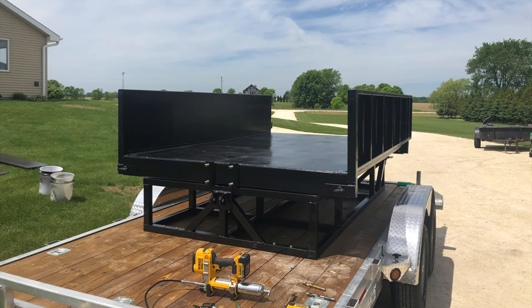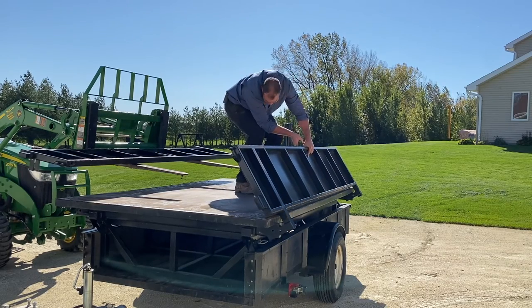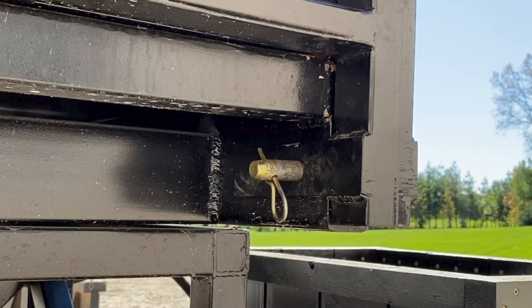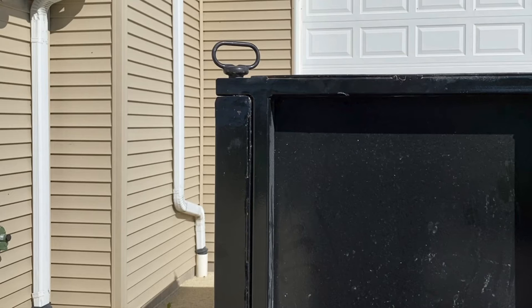The face of the sides are 11-gauge steel that's bent on a brake — I took those into a professional shop to have that done to strengthen them up. They're bent over the frame that was made, and they just tip up into place. The pins go through the bottom to keep it from pushing out, and there are pins at the top as well. Those little quarter-inch steel plates go over the front support and go through with pins and it all fits perfectly. The front also has mounts for the hydraulic ram. I made little ears that go over and the pin goes down into the side to keep the top from pushing out — that thing is rock solid.